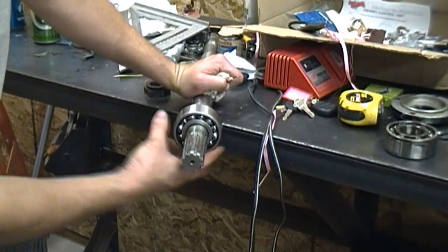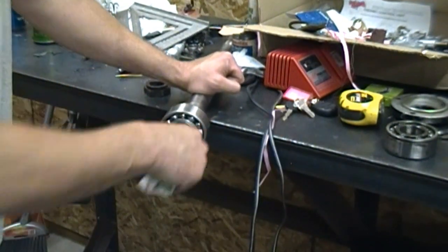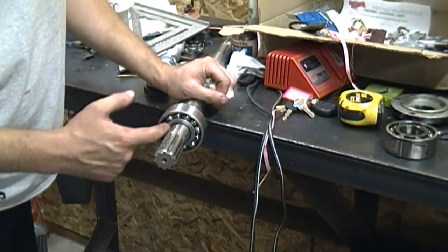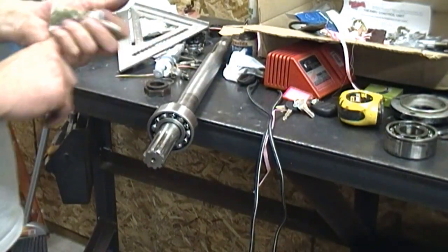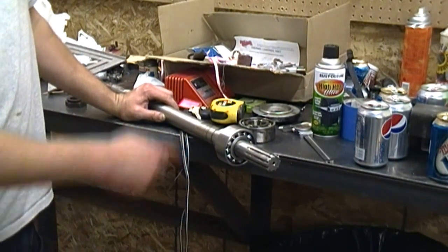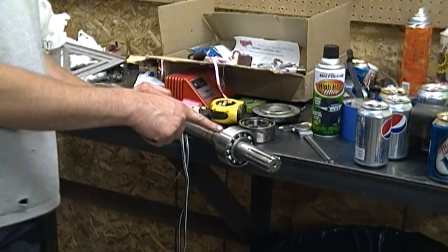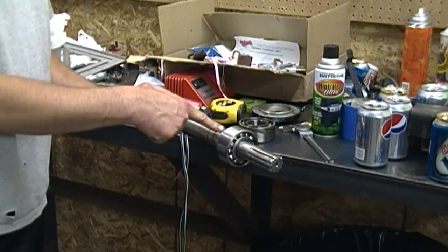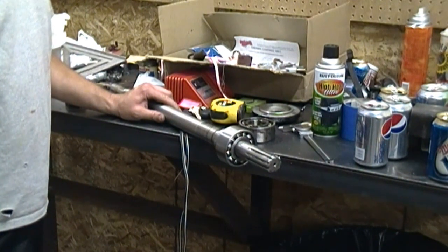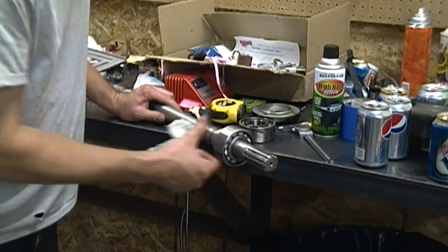I got my bearing pressed on — it was a really good press. I'm just going to wipe off all the excess Loctite; you don't want any of that in your bearing. You can see it's right at the snap ring groove, so it pressed on to the perfect distance. There were some other good suggestions for fixes: adding weld and turning it down — but that risks warping the shaft; drilling and tapping the steel sleeve for a set screw — I liked that, but it wouldn't work for the bearing; and hard chrome — but that sounded really expensive. I'm pretty pleased with the way this went together.